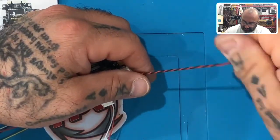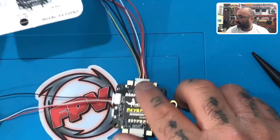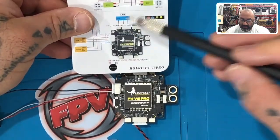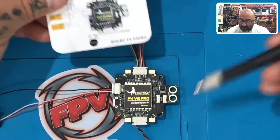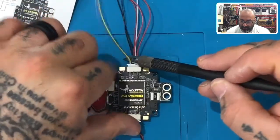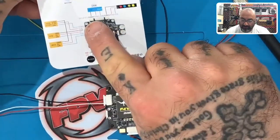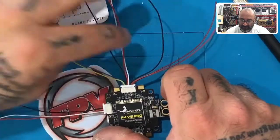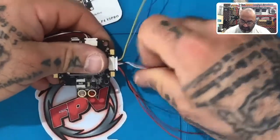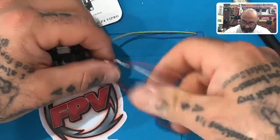Now all that's left is the top plug. According to the diagram, it starts RX1, TX1, ground, 5-volt, camera ground, 5-volt LED. We're not using LED on this build, but we are using the camera. So the blue and yellow come out, the next three wires stay - those are black, red, and white, which are your camera wires. Twist those together so you don't accidentally remove them.